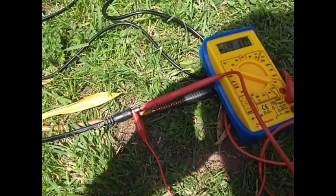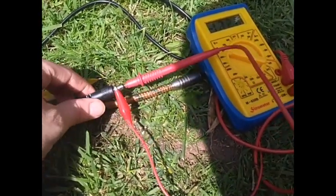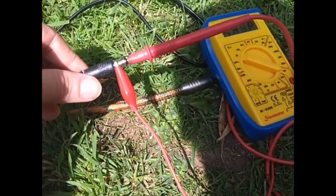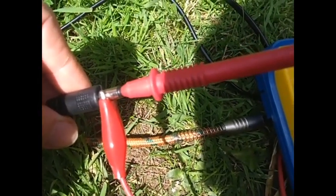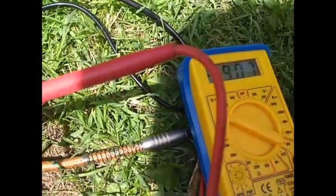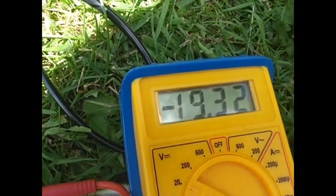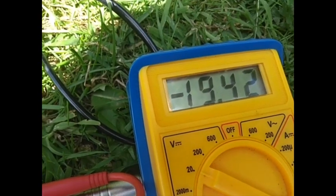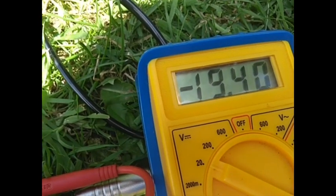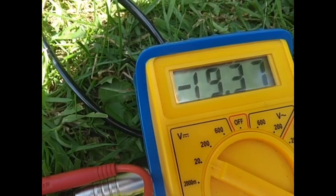As with all things electrical, it's a good idea to test your voltage to see if it's the right way around so you don't blow things up. I've got the outer skin of the plug going to COM and the inner prong going to the volts on the multimeter plug, and it is reading minus 19.3 volts. This will fluctuate slightly according to the sunlight, but this is about the right voltage — the amp is rated slightly higher but it will bog down when drawing a load.